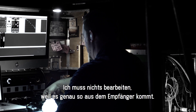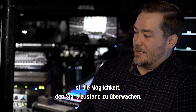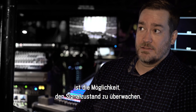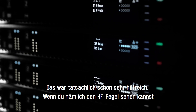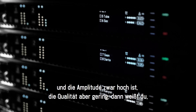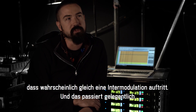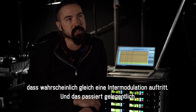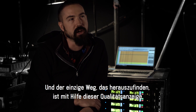I'm not fixing anything because of how it's coming from the receiver — it's just wide open. The other part I love is we can actually track the health of the signal. If you see the RF level and the amplitude might be great but the quality is low, you know you're actually right on top of probably another intermod. That happens occasionally, and the only reason you would figure that out is through that quality meter.